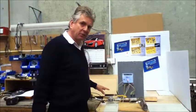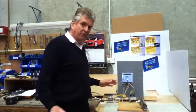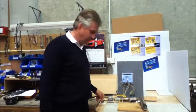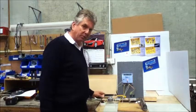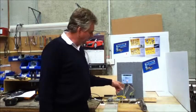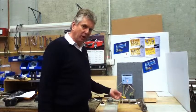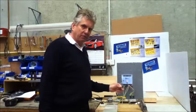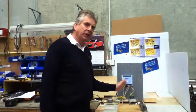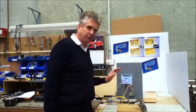In this situation with the combustion fan and pressure switch, it's going to make sure the pressure switch is open first, because if the pressure switch is jammed closed, we could get a dangerous situation. We've turned the fan on, so now it's waiting for the pressure switch to close. You'll see there's a little LED flashing — that's indicating we're waiting for the fan. There are a number of codes given in long and short flashes, and you can download all those codes from the website. There are a few of the more basic ones on the box, but the full list is on the website.